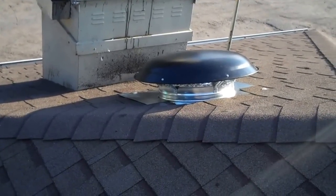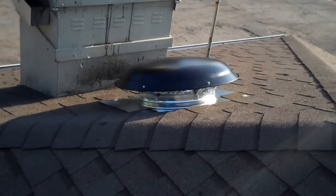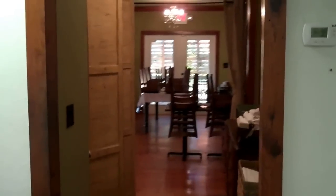Here's our intake with the motor taken out. It's right next to the exhaust, but that won't be a problem. Here's the intake for the stove. Here's the kitchen area — dishwashing area here, goes to the dining room. This is kitchen, stove, exhaust hood up here. It's two air handling units feeding just this little area here of about 15 by 45 feet long — a total of nine tons of cooling, which is pretty nice for the employees to get cooled off.